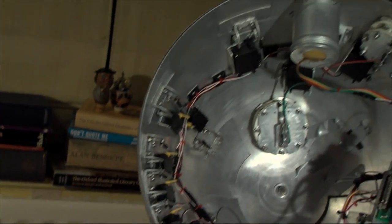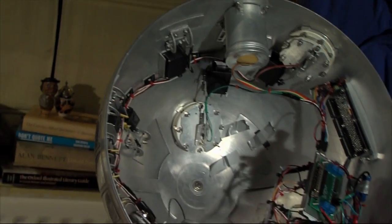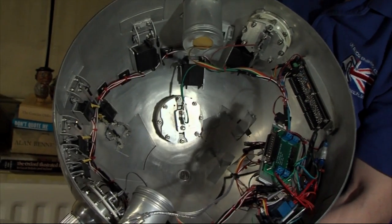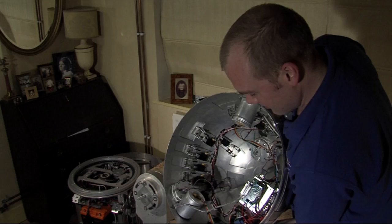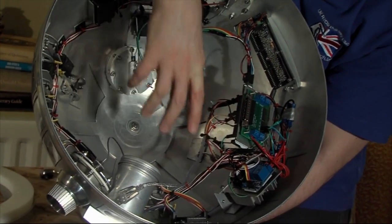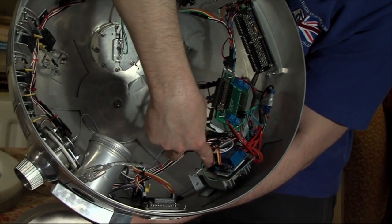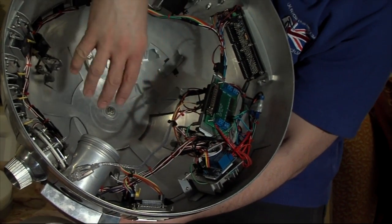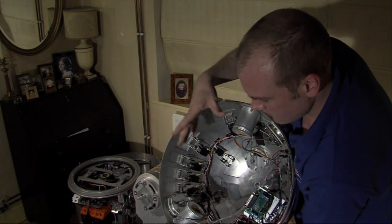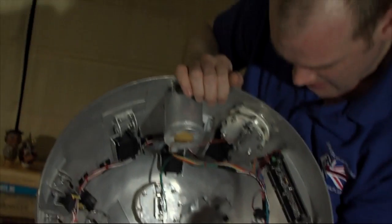We've got 9 doors and 3 HPs. This is the top one — anti-twist, child-proof mechanisms to make sure that the kids can't twist the wires and pull it all to pieces. We've got an Arduino on the back of here which controls an Adafruit I2C servo controller. Those servos are controlled by relays, so when the servo's not moving it's not powered, so it can be moved by hand and the kids can then open the doors and not do any damage.